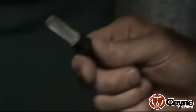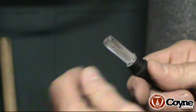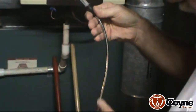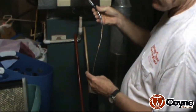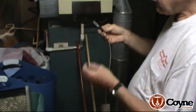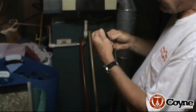You might ask, what's water doing around here? Well, sometimes when you're checking inside a condensing unit around the compressor, and you'll see this outside when we go — sometimes there's some standing water. Remember, this is all negative pressure: we are sucking in the atmosphere, hopefully contaminated with refrigerant because we want to find the leak. You don't want to suck water into the unit, so this will prevent that. I like the technology — I've called them for technical assistance, no problem.